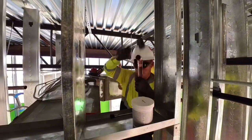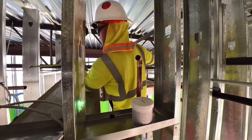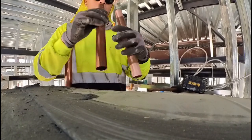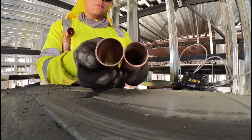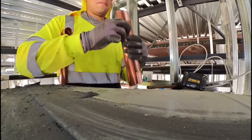You're going to see me pull the marker out and mark the pipe. Because I'm new, I'm still not sure how much it's going to go in or when it's completely seated. So I just like to mark the distance that the 90 is going to travel inside the pipe and use the red mark as a guide so I know where it's at. This pipe right there — I dropped it and bent it, and because I bent it, it wouldn't go into the 90 anymore, so I had to discard it and use a different one.